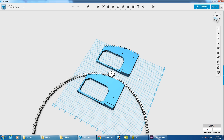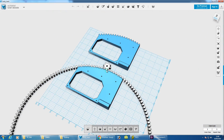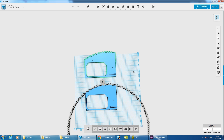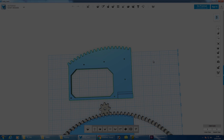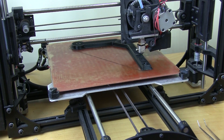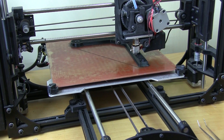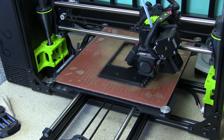As with the previous parts, I've made my own toothed track by cutting one tooth off a gear and then using the circular pattern tool to map it around that radius. I decided 142 teeth was the right number, so I broke it out and merged it. As before, I did a short test running one of the gears along to check the count and spacing were correct.